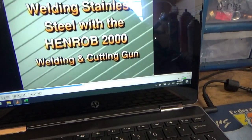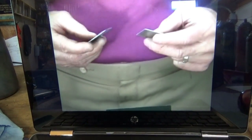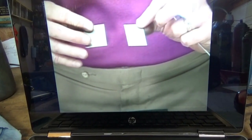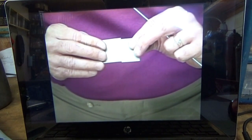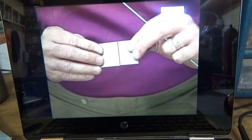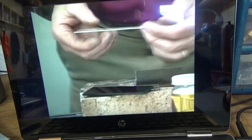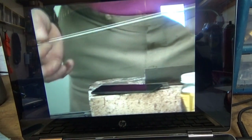Let's watch how to weld the stainless. Now we're ready to weld some stainless steel — this right here is just some regular 304 stainless. We can weld from very thin stainless up to about a quarter inch. We highly recommend about a one-sixteenth to one-eighth inch gap when welding stainless. I'm using a 316 stainless steel TIG rod. You don't have to use any flux or anything — just a standard TIG.